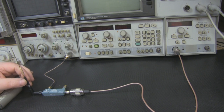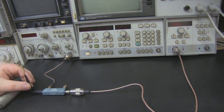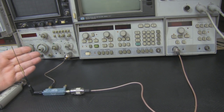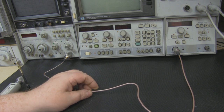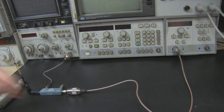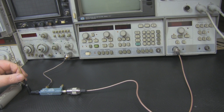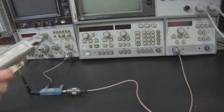I have a box of rigid coax and I was thinking of making a jig to connect the spectrum analyzer or the network analyzer. It'll be a lot more rigid and support things so it's not just wobbling around on the bench. The rigid coax is a lot more professional than the current stuff, which is a little bit lossy. On the network analyzer I have to compensate for that loss, but the rigid coax is quite good and I got a box of it pretty cheap. I can use it on the spectrum analyzer or connect up one of these detectors and measure the VSWR on the network analyzer.